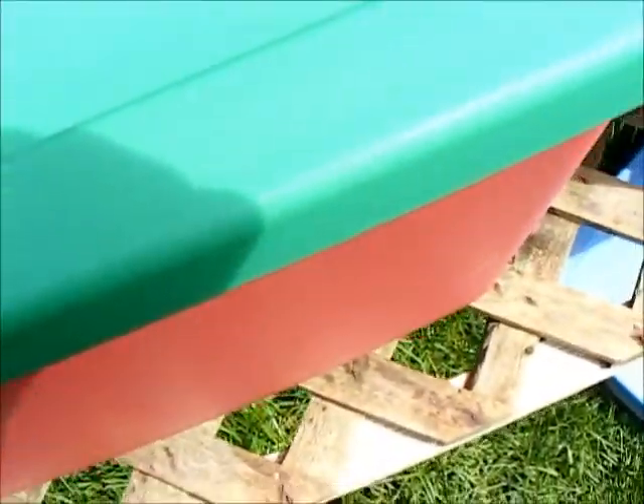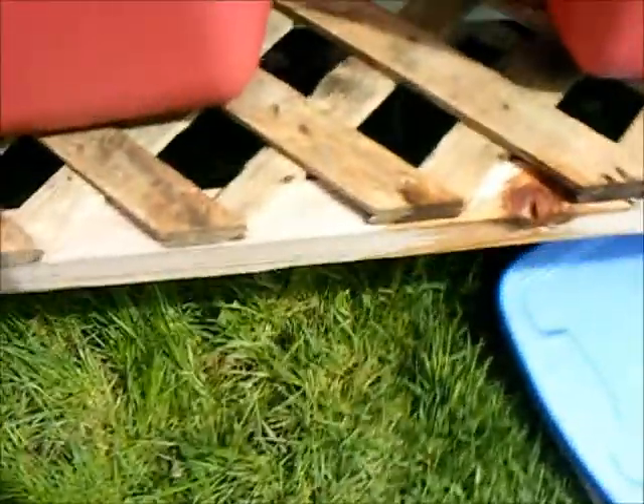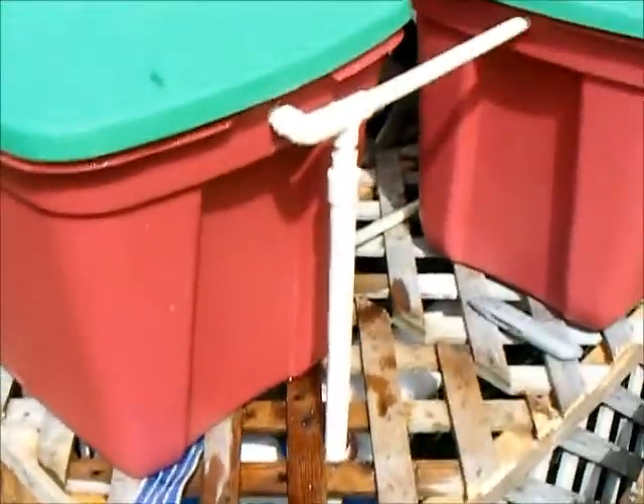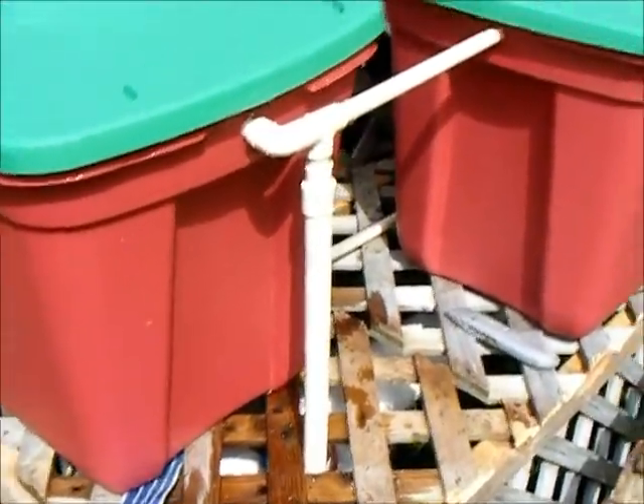It's got a good drain. The drain system I made myself — there's pipe right here, I just strapped it in. Everything I used was laying around my house. I put my own end cap on there and it's holding. The drains are three-quarter inch, so if any water gets through there, it'll hopefully flow through. I haven't even sealed up the pipe yet because I plan on adding on.